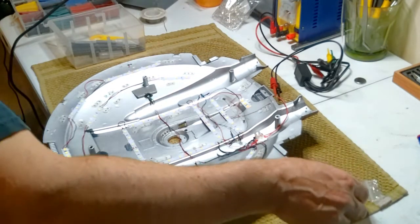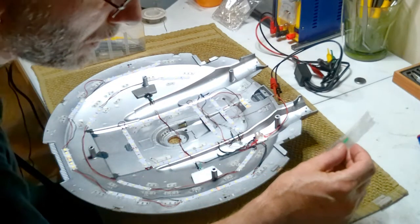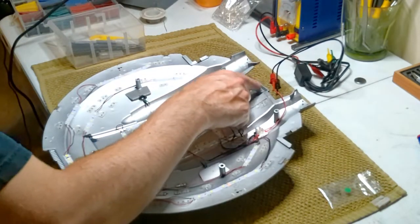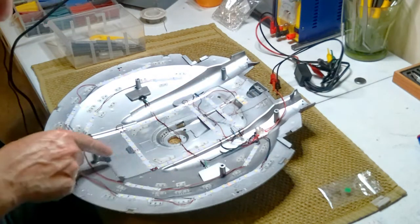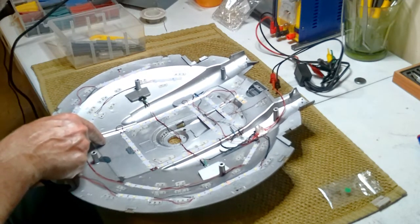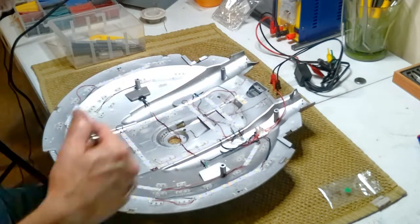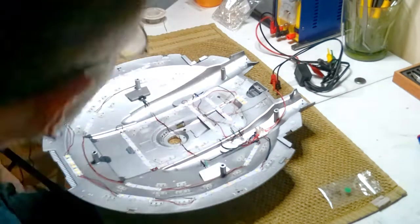Even then, he has a LED here, so those should have a resistor too. So there's 1, 2, 3, 4. You know, we got 2 for there. Then there should be 2 for these. And then there should be... So I actually should have 1, 2, 3, 4, 5. I should actually have 6. I should have 2 more. 470s, I would think.